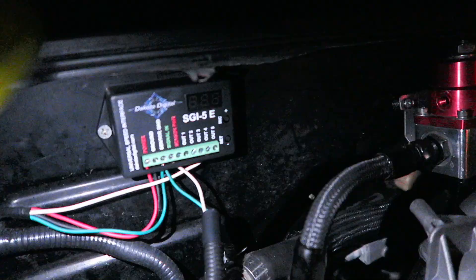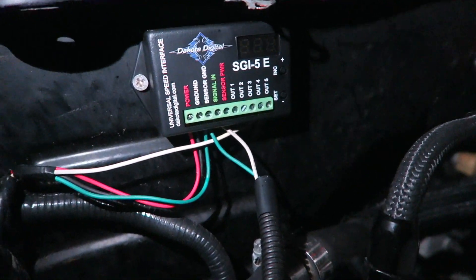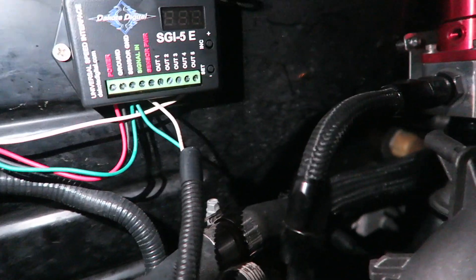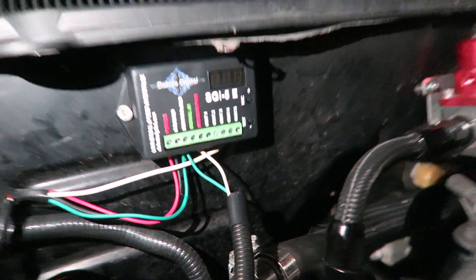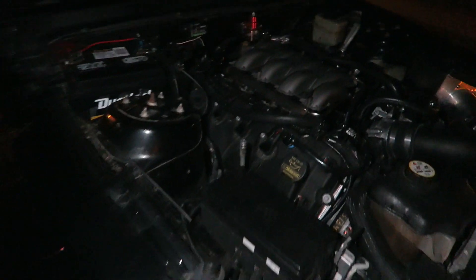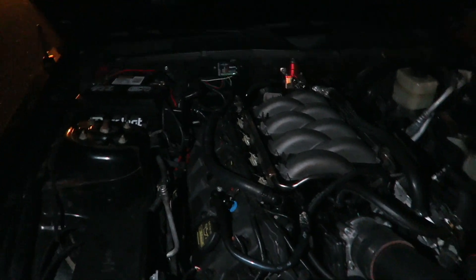Real quick, let me show you something. Each of these little screws right here — you tighten that to squeeze in the wire, stick the wire up in there, tighten it with a tiny screwdriver and you should be good. Now to calibrate it you have to just read the diagram — I'll link it in the description — but for mine it's 0.38, that's what mine is set at and it fixed my speedometer. If you have a coyote swap it might be a little different, but you can start off that number.